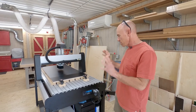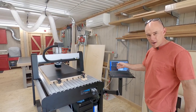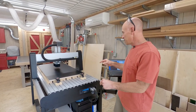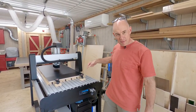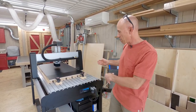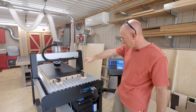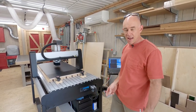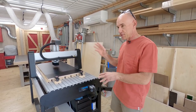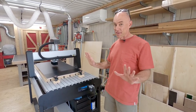So here's what we're doing. We've got it laminated. I've got the countertop programmed in with the cutouts where I want it into the CNC. I've simulated it on the computer. I've even run a dry run of the router around here with the bit missing just so that I could make sure that I wasn't going to crash into anything. It should all be fine. All I have left to do is to set the depth of the Z-axis and then fire it up. According to the simulation, it should take about 9 minutes to cut this whole thing out. So we'll see if that works.